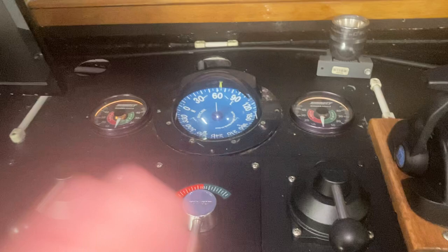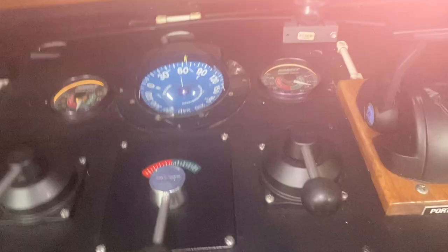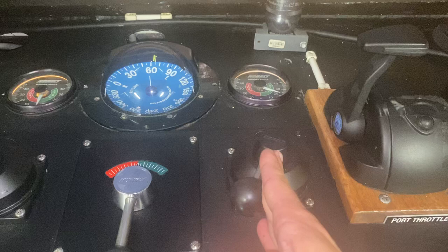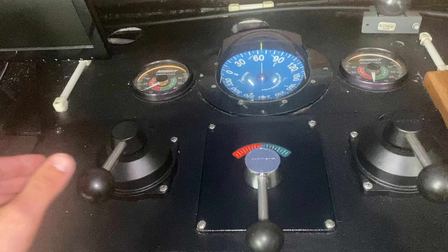With non follow-up steering, it's essentially just a toggle switch. If you move this rudder handle — I have to put it in non follow-up mode — only one rudder will react, and if you let off of that handle it will stay there. If you want to put it back to center you have to go back, and you can leave it in the centered position. The same goes for the other rudder.